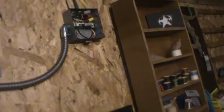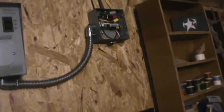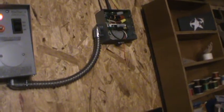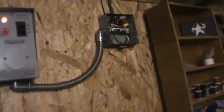I've got a 20 amp breaker on my circuit in the house and I never really max it out, only sometimes if I run the air compressor and then maybe the table saw together. That might trip it, only because I've got a long run from my house to the garage with my wire, so the voltage drops.